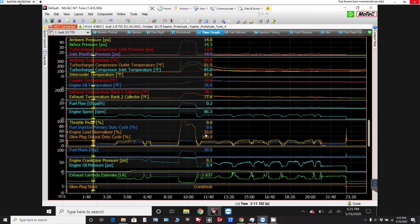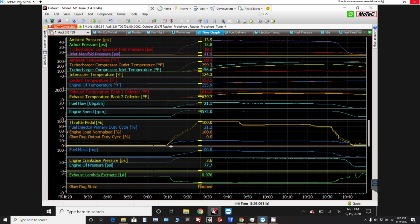So let's look now at how that run up went. If I zoom in on that section, you can see here the throttle, the yellow one. I tried to throttle up as quickly as you would when you're just taking off, but I don't want to just slam the throttle, because there's enough power in the engine that when the prop is at flat pitch it can easily go over 4000 RPM. The prop is designed to only run with a maximum engine speed of 3800, where the prop would be at 2400.